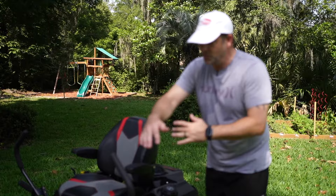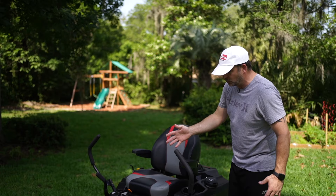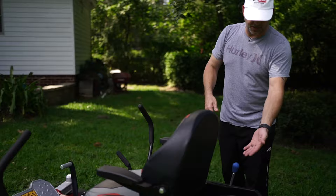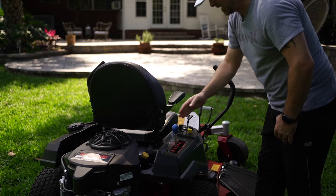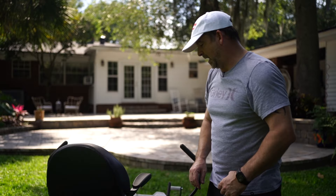Let's do a quick walk around and show you some of the features. The first thing I want to talk about is this MyRide suspension — it looks completely different than a normal zero turn because it has this platform with a beautiful red spring. The old one had two springs on the back you had to adjust individually, but now they have a one-handle system to adjust the tension. That's the strongest setting — I can barely move it — and that's the softest. I prefer it pretty soft, but if you weigh more you want more tension, and if your wife's going to be mowing she can dial it down for a comfortable ride.